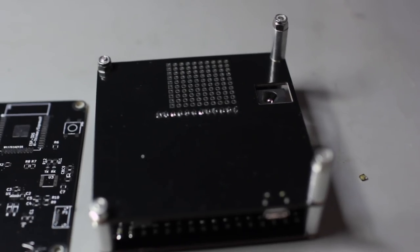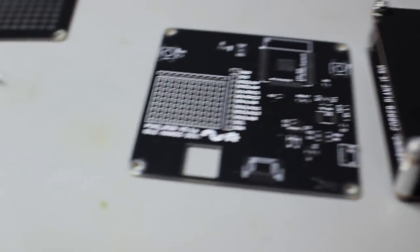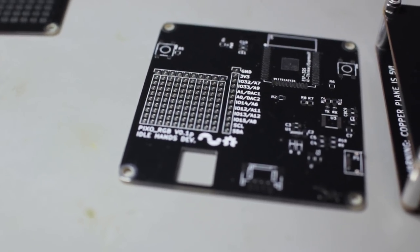That's it — it is fully assembled. I haven't tested it yet. There are a lot of LEDs; it was pretty painstaking. For the make 100 I'm probably going to get the LED part assembled professionally, since I've never gotten a mass order of assembled PCBs — I think that'd be fun — and then I'll solder the rest myself. If you notice, the board also has a protoboard on the back so you can add your own components like a temperature sensor or an accelerometer. You could tap it if it was an alarm clock, have it show the temperature or humidity of your house. It's just a little extra feature because there was some extra room on the board.